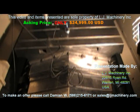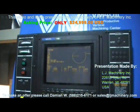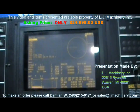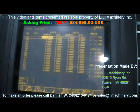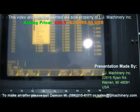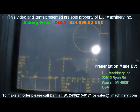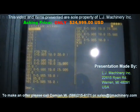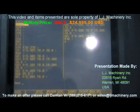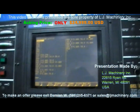I'll get those results available online. This machine with the Seicos M3 controller has very, very nice options, including graphics and a tool file with geometry. You can choose your tool names for graphical input of a program. You can do it both ways — either graphical/conversational programming or straight Fanuc G-codes. When I programmed the ball bar test I used straight Fanuc G-codes, and you can upload and download your Fanuc programs and they will work just fine without any major modifications.